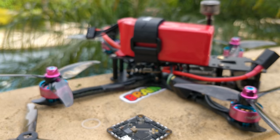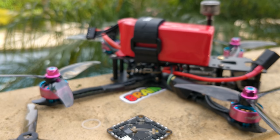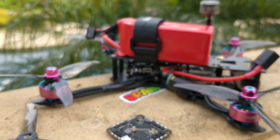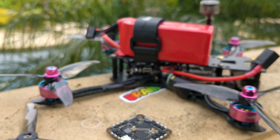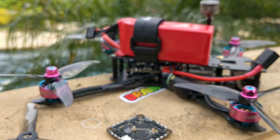That's basically where things may be going. Four-inch may not become all the rage or gain a lot of traction, but in my opinion, the Caddx Vista unit just fits four-inch so much nicer than three-inch. You can squeeze it into a three-inch, but you'll have to stack boards up with the battery way up high or slung underneath — neither of which I'm a fan of unless going super ultra-light. If you pull out to a four-inch body, you end up with proper room, and four-inch just makes more sense for the Vista if you're looking for really good performance.